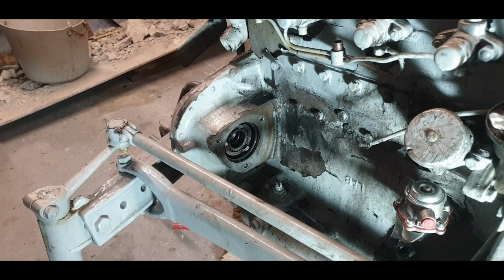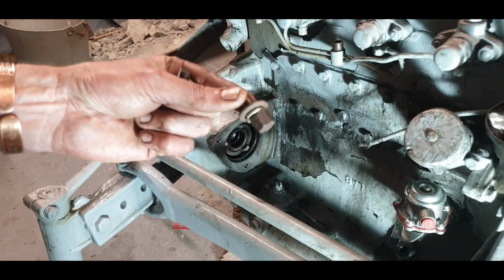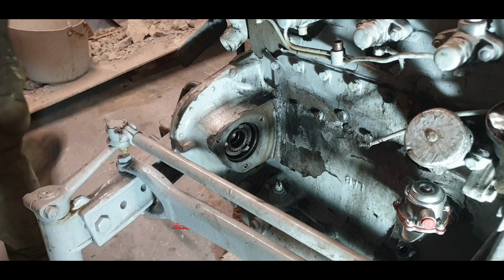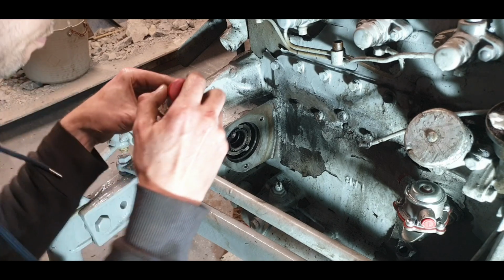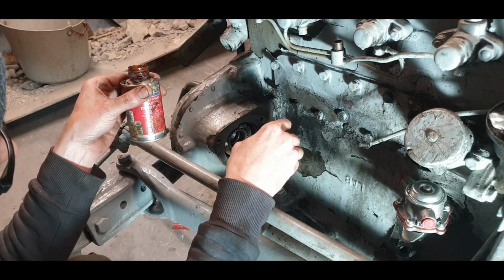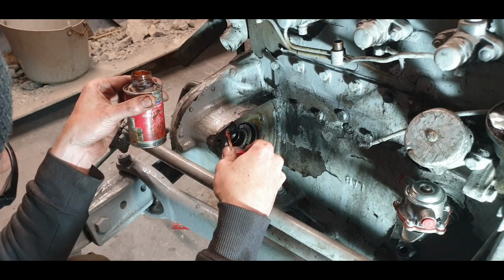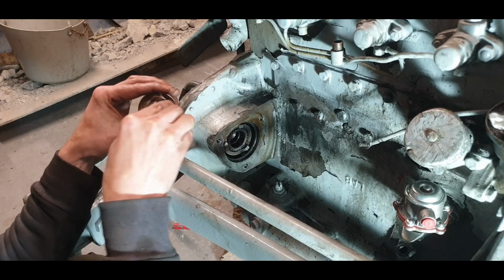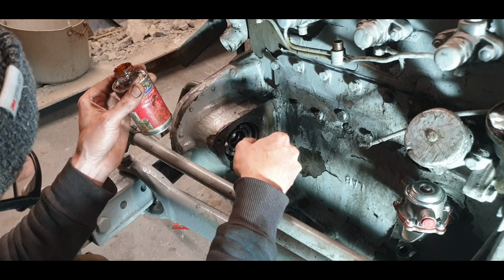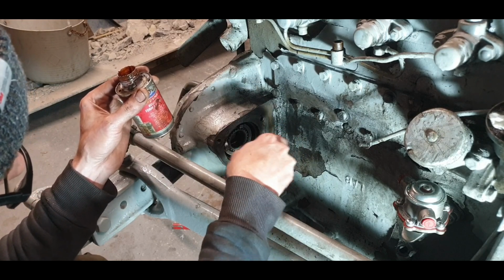So what I do with these is I put a spring washer on them as well, because it's important they don't get loose, and a nice wide washer, because you want it to grab that flange of the pump, and you want it to pull nice and even, because I've seen some of these flanges actually breaking. So we have our gasket on the pump, and it's stuck to it. So plenty on here. Got a good degreaser wipe as well.